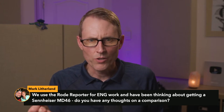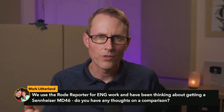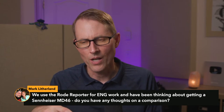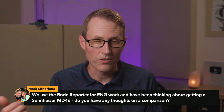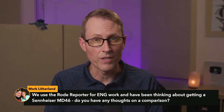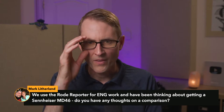The MD46 is obviously directional, so that's really helpful for interviews in really noisy locations, but you have to get it oriented correctly. The Rode Reporter is just dynamic, and it's omnidirectional, if I remember correctly. So that's just keeping the microphone between the two of you. So it's not going to reject as much, but it's also a lot more forgiving if you don't get it aimed exactly right. So there's a trade-off there.